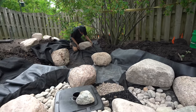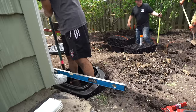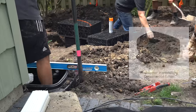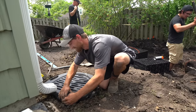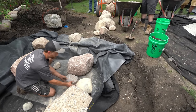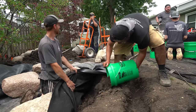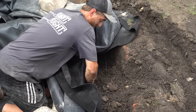This job is also going to have a dry stream bed off the end of it. The dry stream bed was really important because of the first flush rainwater harvesting system — I knew the amount of water coming down that downspout was going to overwhelm the small reservoir, so we needed an adequate overflow built in. A dry stream bed was the perfect opportunity to take that extra water out. Often the rocks don't fit exactly the way we want based on excavation, so don't be afraid to dig out a little more or backfill toward some of the rock you're setting in.